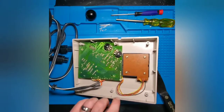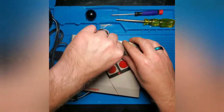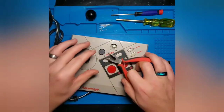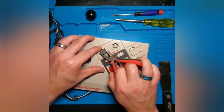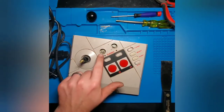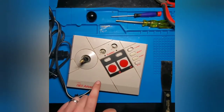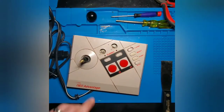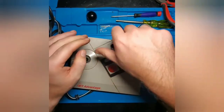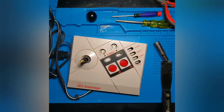We're going to take out those six screws. We also need to turn over the controller and take out the turbo knobs — one of them is being a little stubborn, but there we go. Now with the turbo knobs off, if you look down in there you can see there is a hex head nut that secures these switches to the face plate. Those nuts are a 10 millimeter nut, so I'm going to take a 10 millimeter deep well socket and get these nuts off. Once you do that, the board's going to drop away from the top of the casing.